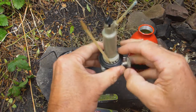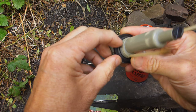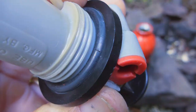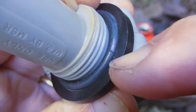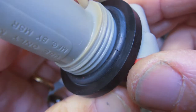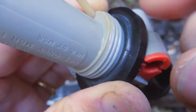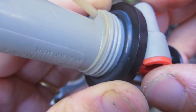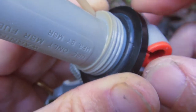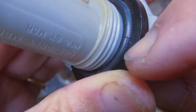It's important that all the o-rings on the seals are kept clean — no dirt or knife marks on them. If they're cracked... let me have a look — that IS cracked. So I've just discovered there is indeed a crack in this o-ring; it's perished. This would be a lethal situation if I started applying pressure, because this is the pump and it pressurizes the fuel in your canister. If fuel starts leaking out you'd really be in trouble, especially using petrol — but even with kero, any flammable liquid leaking is a real problem.